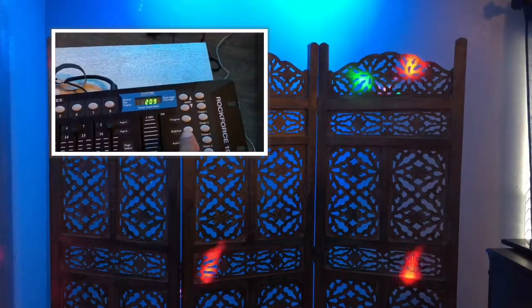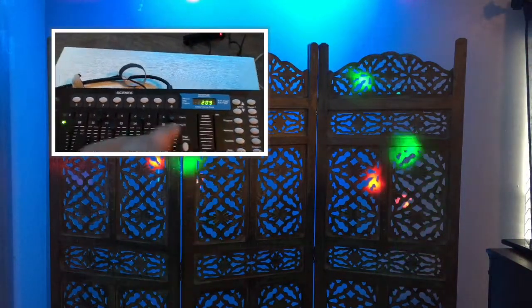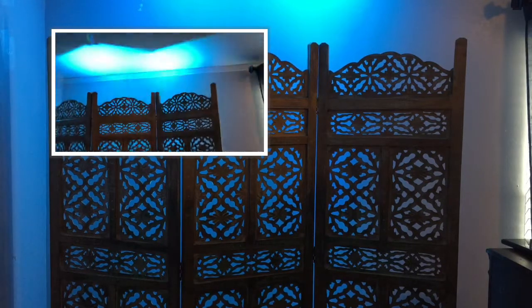And so I say I want to keep this one, so I'm going to go ahead and its program is blinking. So all we're going to do is MIDI add 2. It blinked, and so let's go to our first one, okay? So our number 1, I'm going to press number 1, okay? Simple. Our whole backdrop, our whole room, all our pars they have these nice sky night sky or evening sky blue, and then when we're gonna start the party, you can get going with these.